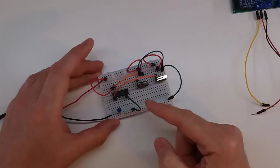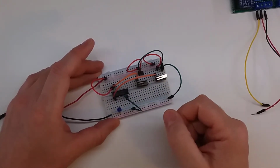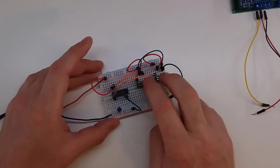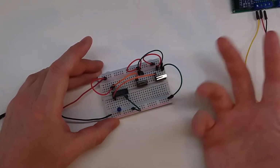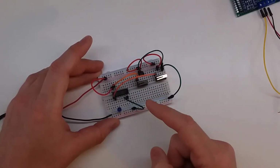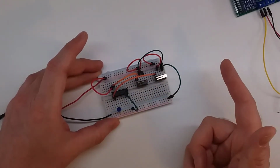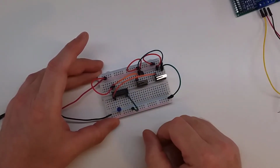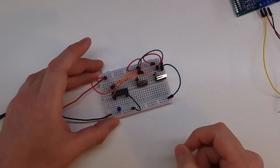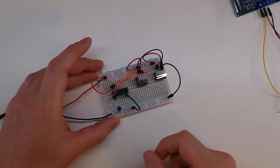So what was this originally used for? Well, it could have been used for a lot of different things. It was probably used to control different analog outputs, or maybe even some signal outputs, just like what we saw here on the switch. So we can digitally control whether or not something is on and off. Today, maybe we could use this to control the output. If we've got 4 of them and we've got 4 different switches and 4 different outputs, we could then control which ones are on and off. In theory, this is not going to have any substantial losses on our sine wave coming in versus out, and we'll go ahead and check that on the oscilloscope.